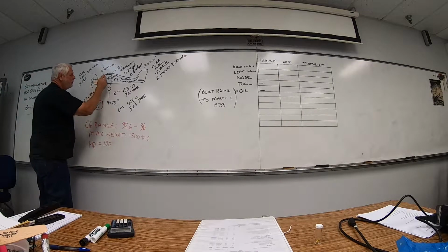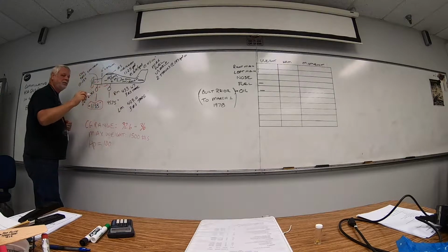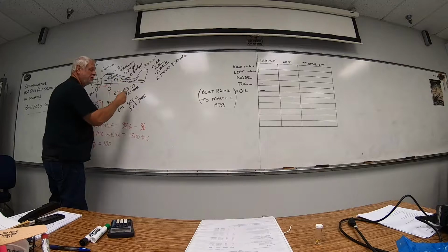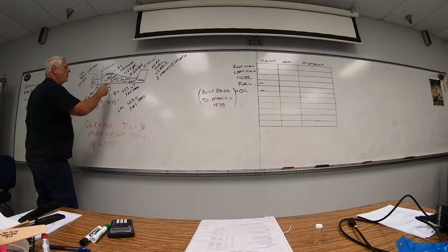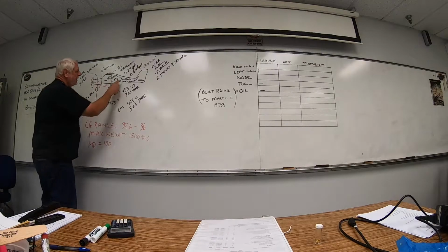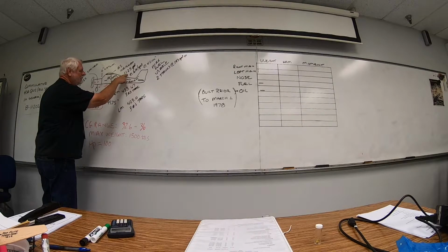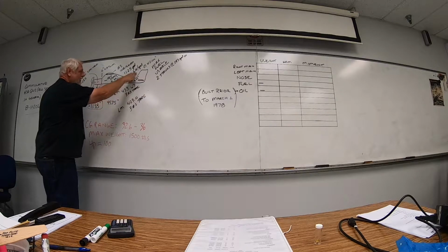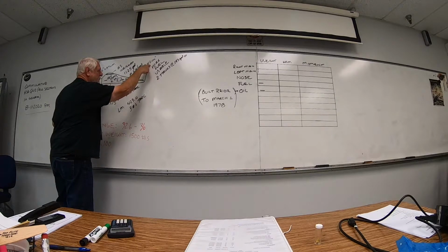So we also have a little bit of fuel in this aircraft. This is as it was weighed, what, 2 months ago? Something like that? I'm asking my class, they're behind me, so I'm going to ask for their help on some of this. So as weighed, it had 11.25 gallons, 6 pounds per gallon. It's 100 low lead avgas, and our station number was at 42 inches.